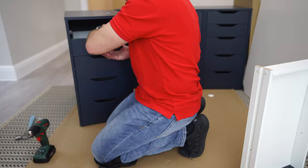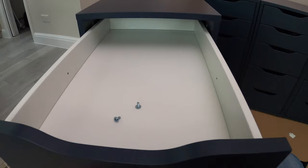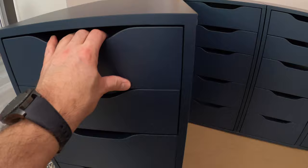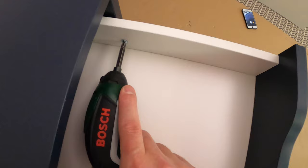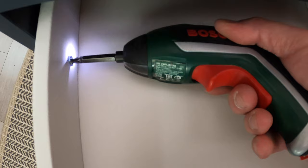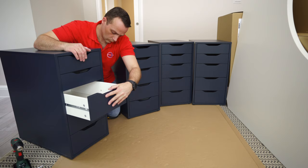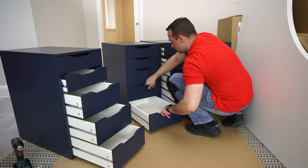This is the first small drawer - just place it in. The top one is a bit tricky with those securing screws, so you have to place it all the way in and then push the drawer out with the rail. If not, just pull the rail out manually and then secure the screws through the side - two small screws there securing the drawer from coming out completely. One on each side. A small electric screwdriver is a big help in any kind of DIY or assembly job - links in the description. This is the IKEA ALEX drawer assembly complete.